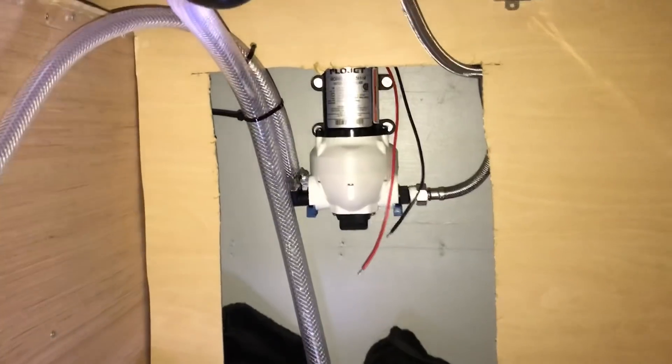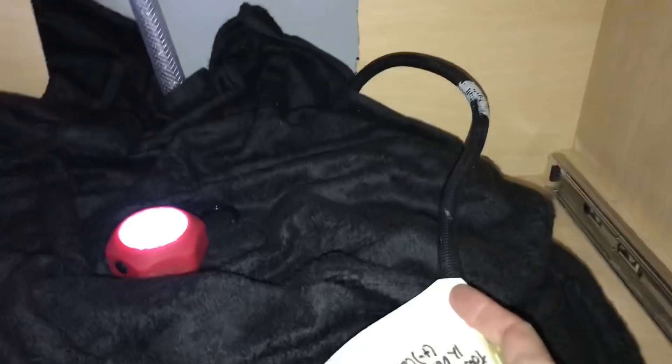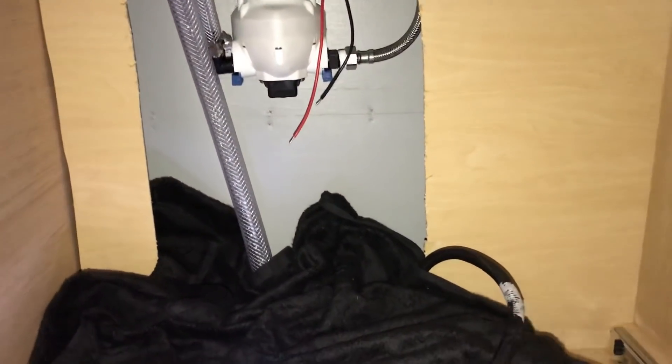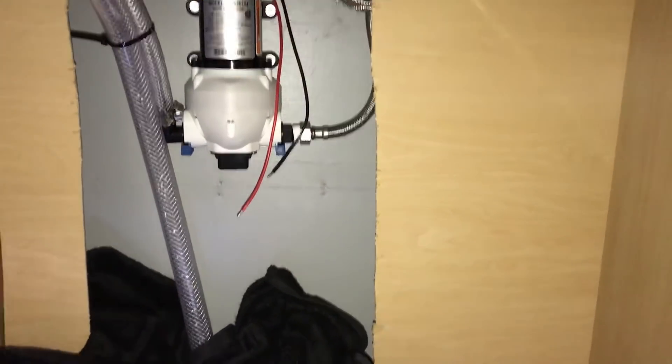It's time to do another test before we get the water tank set up. I put some zip ties in to hold everything in place — looks pretty good. Now, if you've been subscribed to my channel you've heard the story about this little wire. When the vehicle was built they put this wire in the wall — not accessible to anybody. When I was taking the walls down I found it with a note attached saying 'power source 12 volt DC, 20 amps, plus/minus, constant hot.' I wanted to put my electrical box back there because I'd have access to 20 amps always hot.